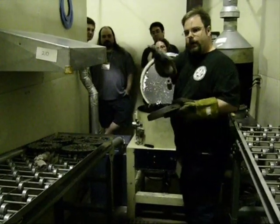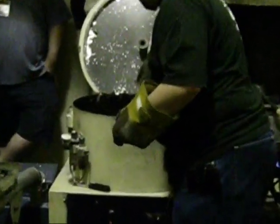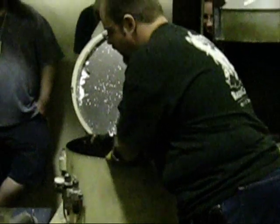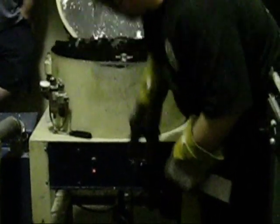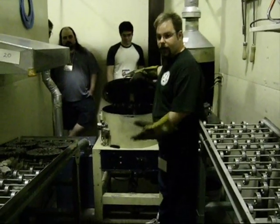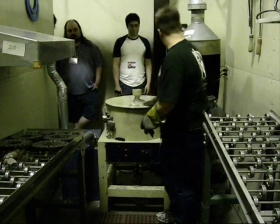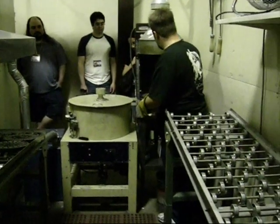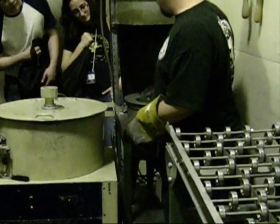So I drop this metal down here in the middle and I'm going to lock this plate down. We're at about 22 pounds of pressure, about 45 RPMs right now. When I lock this in, the hydraulics are going to come up, squeeze the two halves together, and now it's going to begin spinning. This is our pewter mix — this is our primary Dark Heaven, Warlord, Chronoscope, all that. Not our P65 metal.